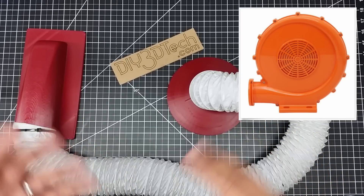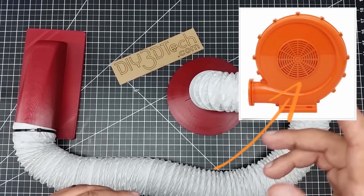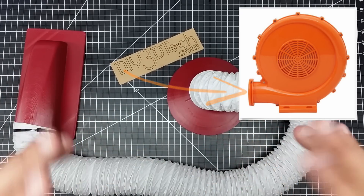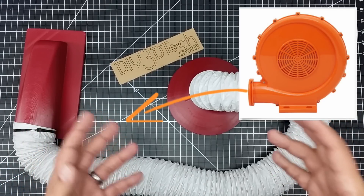The idea is it has roughly a two-to-one ratio. So in other words, it's got a six inch inlet and a three inch outlet. It does about two-to-one compression because the idea is really not to compress the air, but to move lots of air. And it has a one horsepower motor, so it does move a lot of air.